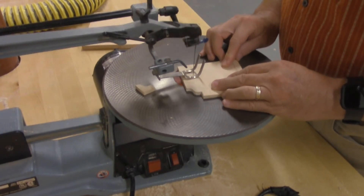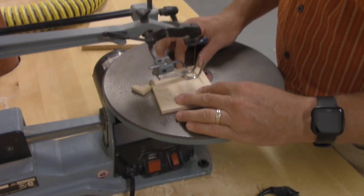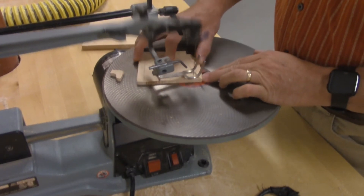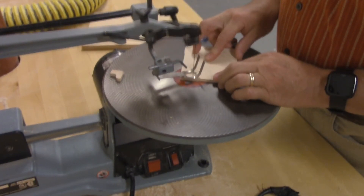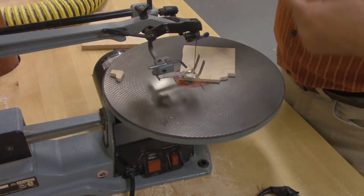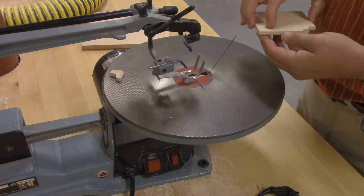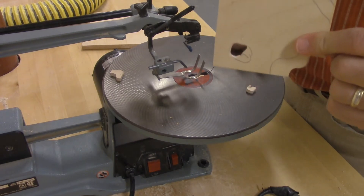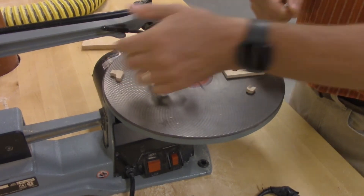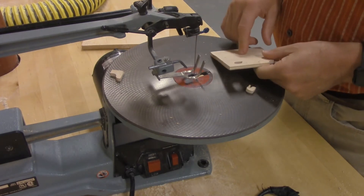You can cut very sharp corners, rotating the piece of wood as you work your way around whatever shape you're cutting. When you're done with your cut, reverse the process: blade tension — pull it towards you, unclamp the blade, and pull the piece of wood out. And there's your interior cut. When you're finished, please get in the habit of putting everything back. That's using the scroll saw to do outside and interior type cuts.